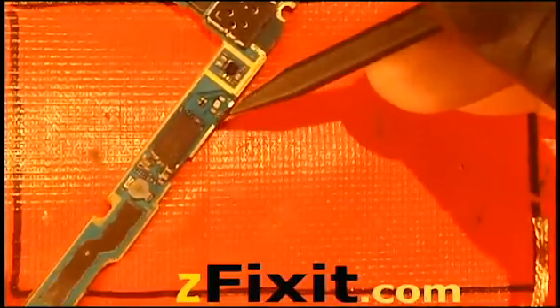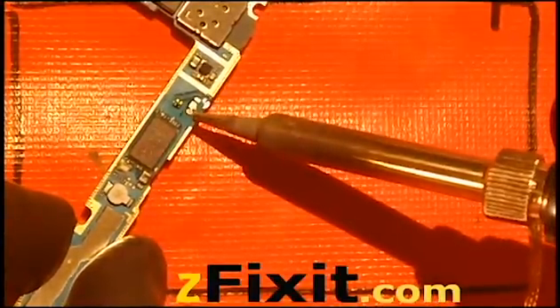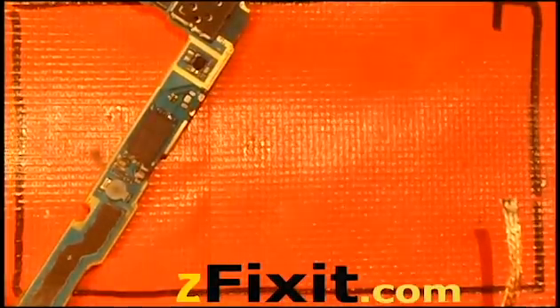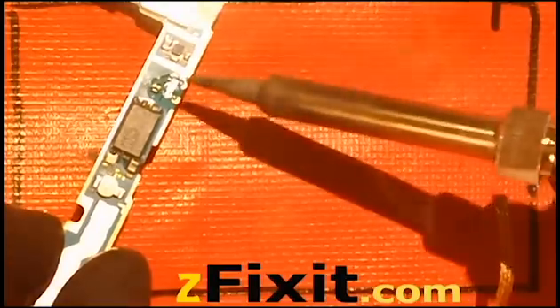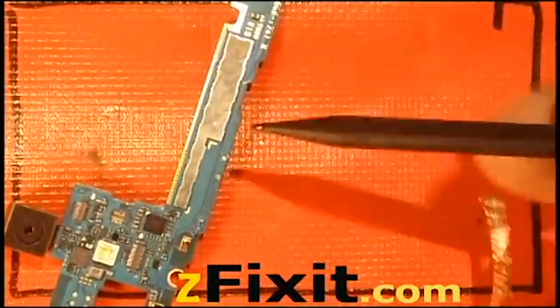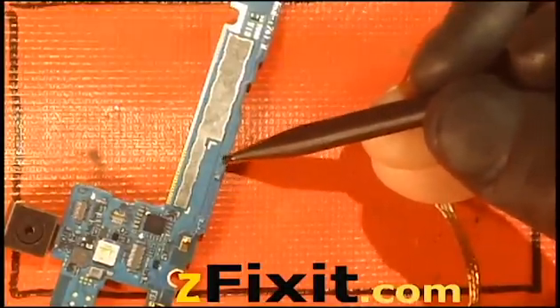So again I'm going to cut some low melt solder and just place it in there. This is very brittle. Once you place it, it needs to be removed so that the new solder joints are strong. But I just put it on there, mix it up, get it into the hole. Just keep the iron on there a little long just to make sure it mixes with everything underneath it. Clean your soldering iron periodically and tin it. Make sure that low melt solder goes into the through-hole anchor point. Go to the reverse side — you'll have to do the same thing: put some flux and then some low melt solder. That should complete the process as far as removing all the old high melt solder.